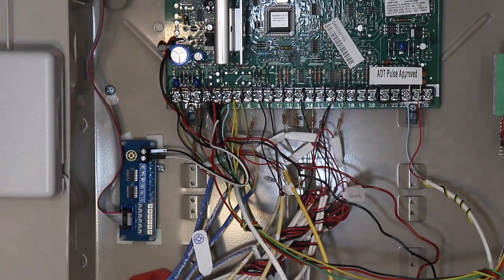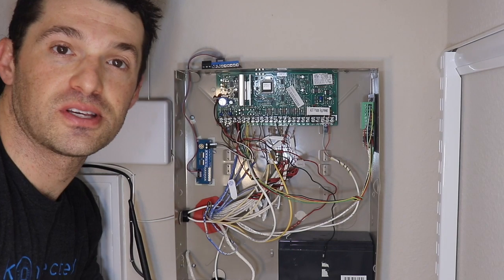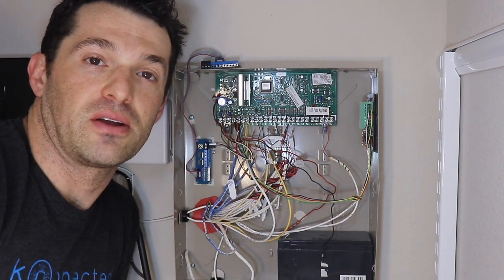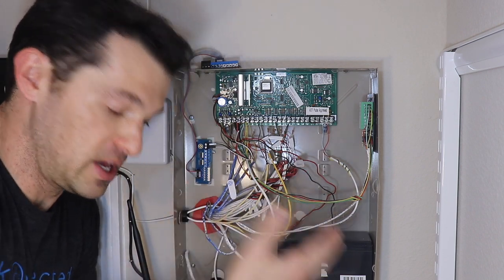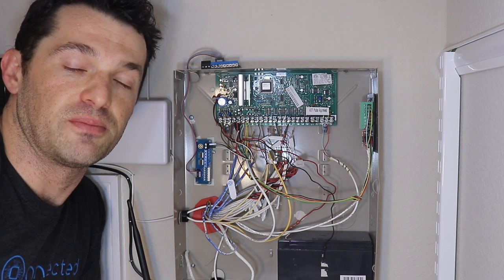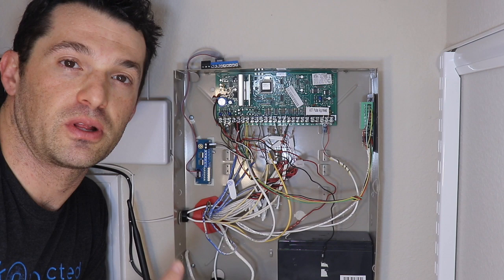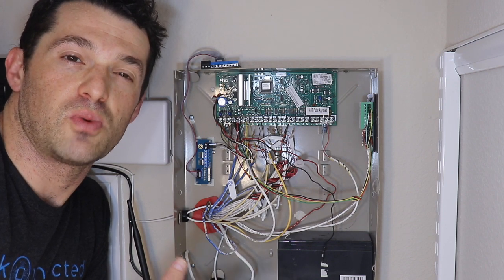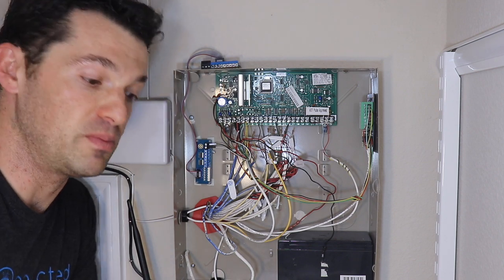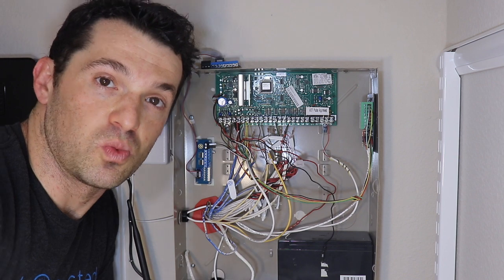However, there's one exception. On these Ademco panels, there's an issue with zone 1. Zone 1 on the Ademco panels, and this only applies to the Ademco panels, or in this case a Safewatch Pro rebranded Ademco panel, Ademco VISTA. Zone 1 is a special circuit zone, which is typically reserved for smoke alarms, 2-wire smoke alarms. In this case, it actually has my entry doors on it, which is also fairly common, but the Konnected Alarm Panel Interface doesn't work on the VISTA Zone 1.